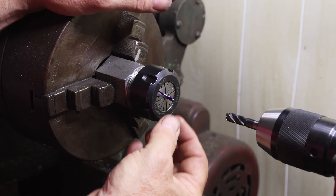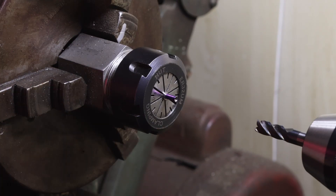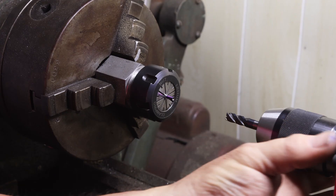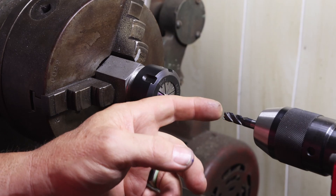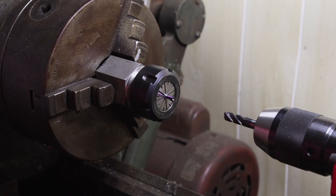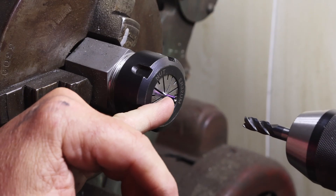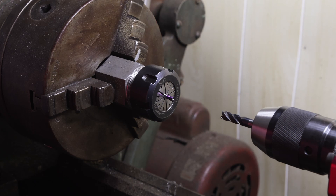So I've got the pivot in a collet, in a collet block here. I know this will make machinists cringe, but this is how I do it and I do a lot of work this way. Over here I've got a chuck mounted in a tool post and an end mill. I'm using a five-sixteenths here, but you could use anything — I'd go double the size, up to very large. I've got it marked with a scribe mark and I can see it when it's spinning very clearly. I'm going to cut down to it and we'll clean it up and check it out.